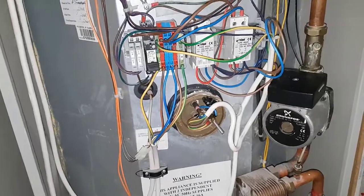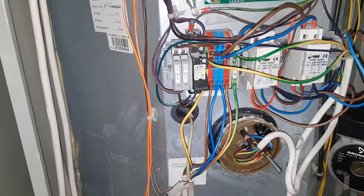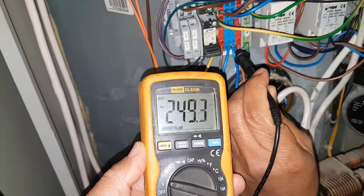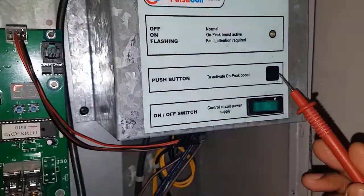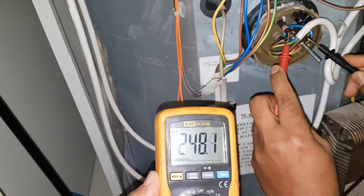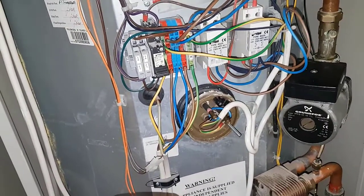As I said, this boiler is overheating. Sunil, I want you to get your multimeter and show people what's going on. Connect your neutral - I'll load your multimeter for you. Go on your neutral block. We've got power coming in on one, which you can see there - that's the feed coming in, which is normal. Now the boost is off, so there should be no power to this bottom immersion heater. Let's go to the immersion heater and show them - go across there. We've got power there when it's showing no power on because the boost is off.